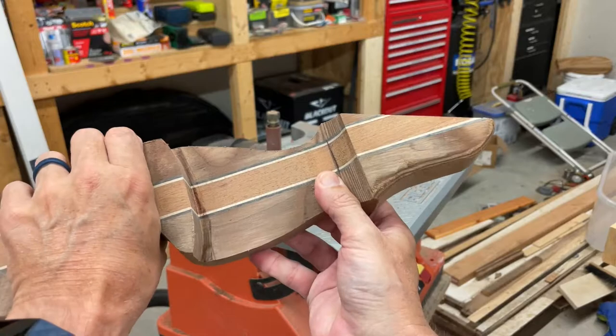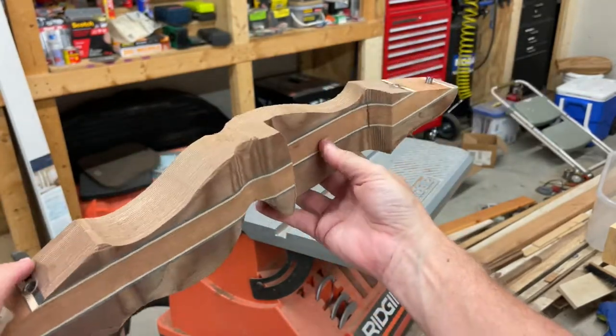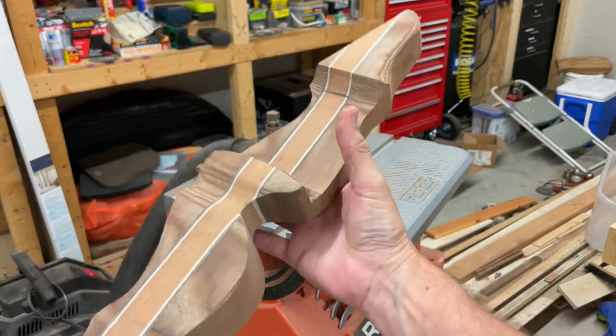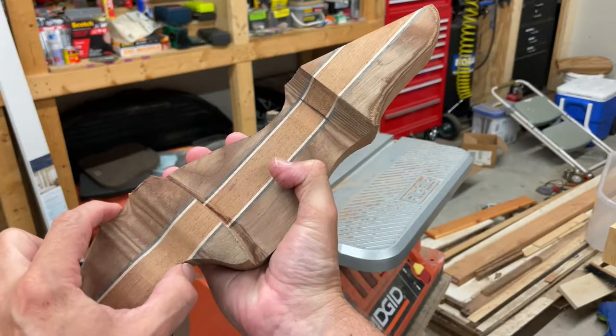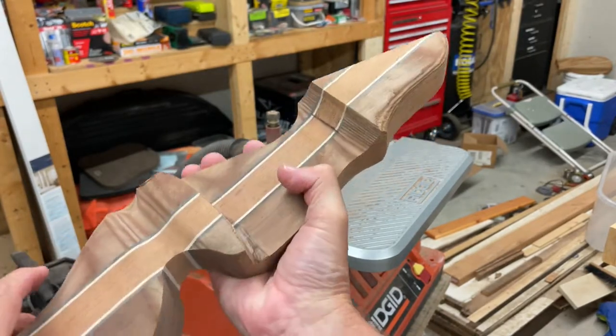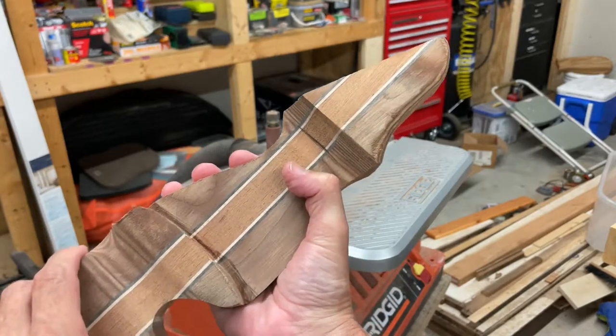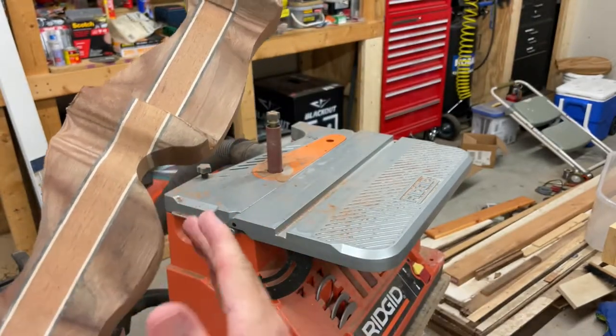Now I've got the basic shape cut out and it's pretty level with the limbs on either side. I'm going to take the limbs off and really start working on rounding over all this stuff — bringing this hand groove in a little deeper, rounding things off, and getting more detailed shape into it. I wasn't sure on dimensions — how far can I go? I took some pictures and posted them and got responses back. Several guys said the handle depth they usually set to one and three-quarters inch by an inch thick, which gives me an idea I can go in a good bit further to get the feel I'm looking for.